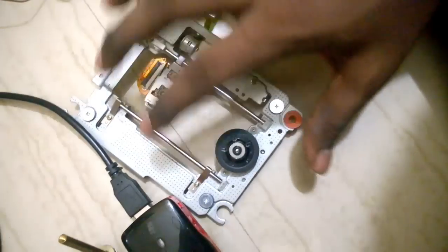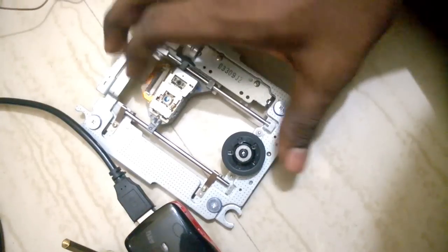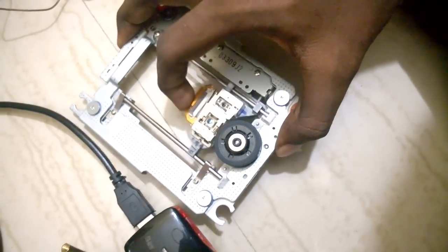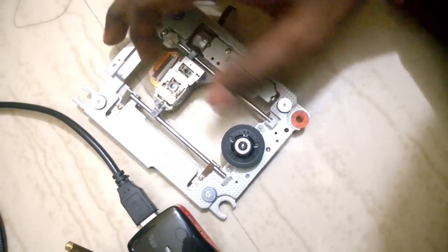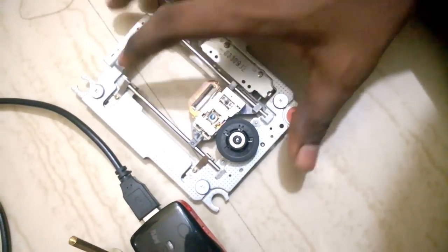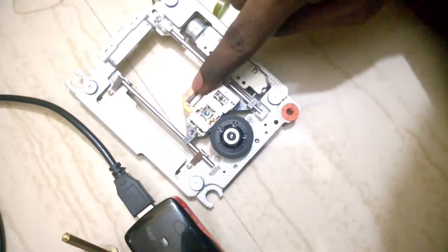This is the whole system in a CD drive. Here you can see that the carriage can move forward and reverse because the stepper motor rotates in the forward and reverse direction. I'm placing an IR sensor here to detect the forward end motion.